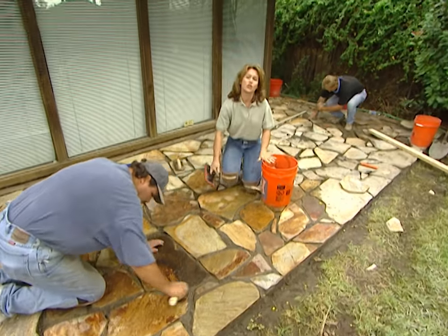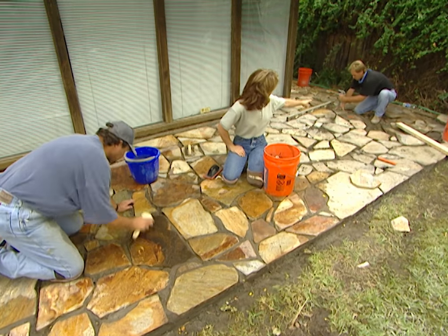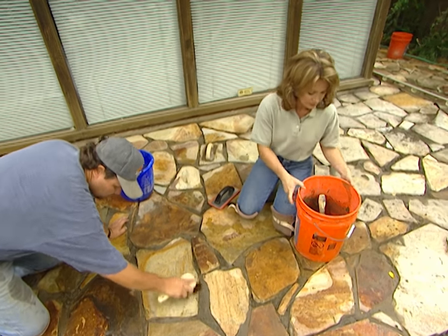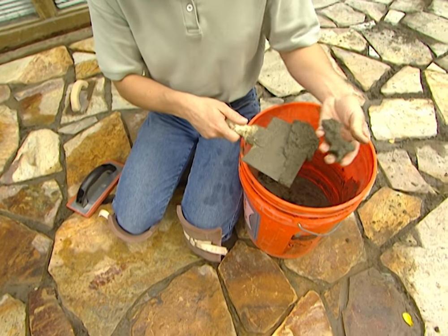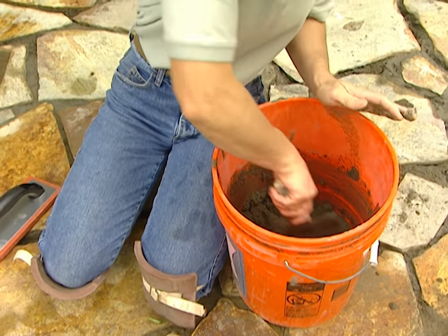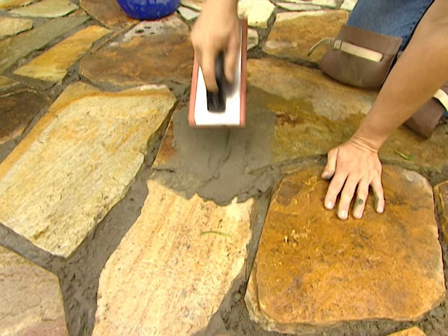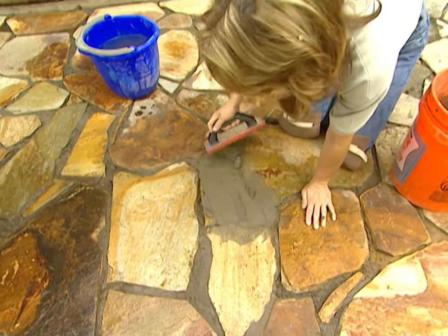This is day three of our project, and as I mentioned earlier it's a very labor-intensive project, so it's been really nice having the extra help. Jeff is still working on the side patio setting some stones, but Brian and I are going to go ahead and grout this area that we did yesterday. You need to let your stones dry overnight before you grout them in. For the grouting step, we've used the same mixture as we did for the setting bed — two parts sand to one part Portland cement — except this time we added more water because you need the grout to be workable. I'm going to use a float, and when you grout you want to force this into the joints — it's just like grouting a tile job. I'm going to let this sit for about three to four minutes, and then I'll come back and wipe this off the top of the stones.